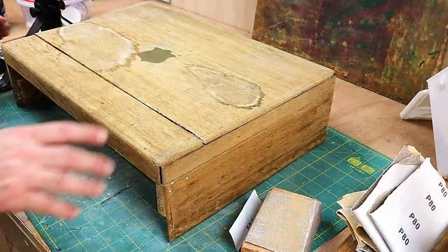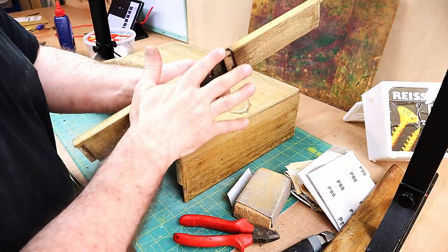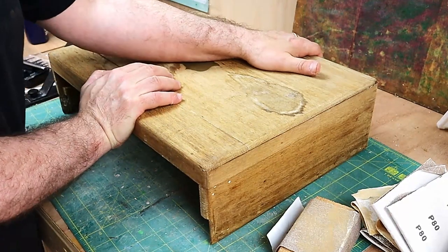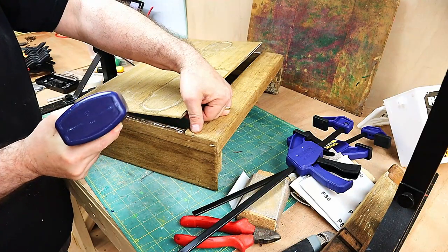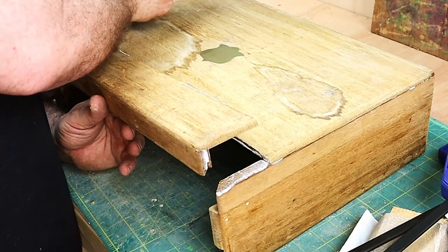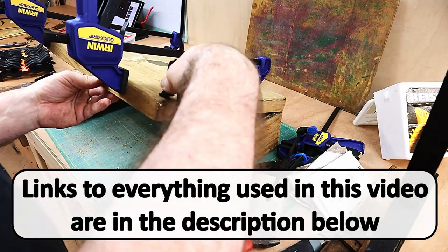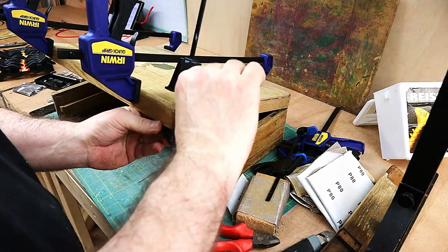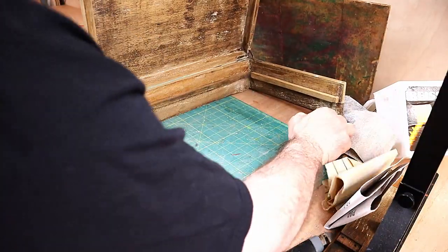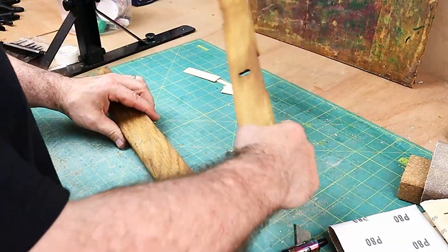I've cleaned up all the underneath here and cleaned all the glue off these bits. I'm going to glue this down using some wood glue and then clamp it so it's nice and closed - that's why I made sure I cleaned all the glue off, so I could glue that little split together as well. I'll link everything I'm using today in the description below, including these clamps - they aren't expensive but they're really good quality. I'll let that dry for two or three hours.